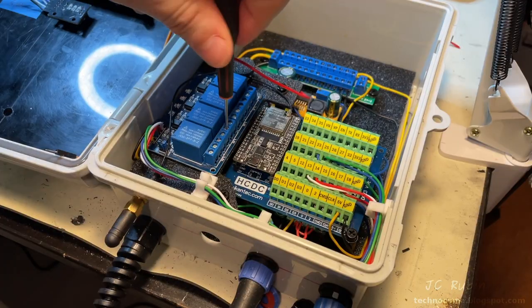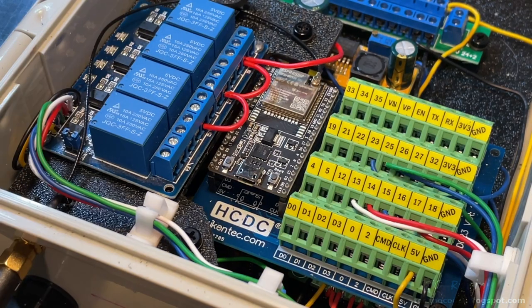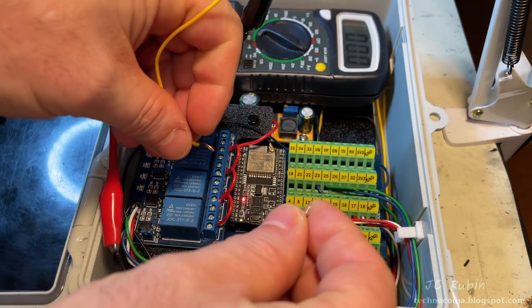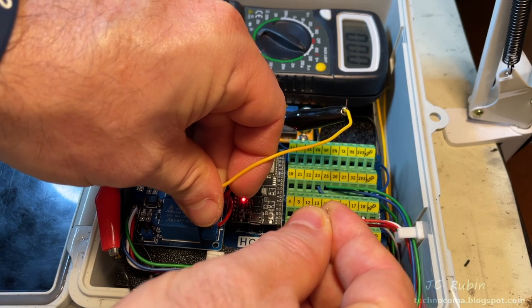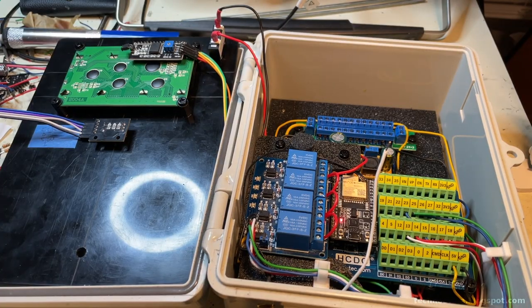This cable comes up and meets the relays, and everything is slowly assembled back together. I pre-cut jumpers — here's our AC making its way to the first relay, then jumpered to the second, and then to the third. I forgot my neutral so I had to go back in and add it. If you look quickly you can see 28 volts flash on the multimeter when it clicks onto the fourth relay.